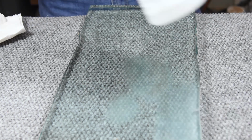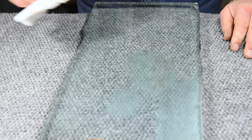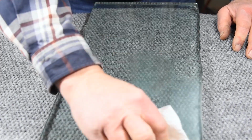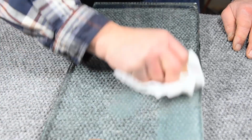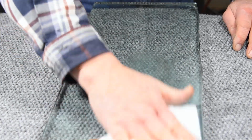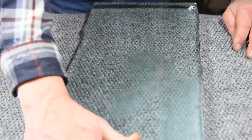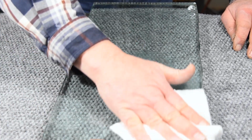And then I'll be able to remove the lapping film as it's used and reuse it again. Just don't want to have any debris underneath the paper. That can really cause a lot of problems with lapping. I lap things almost every day in the shop here, and so I have multiple different ways of getting it done.